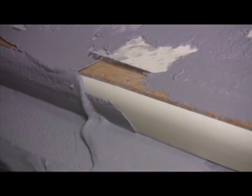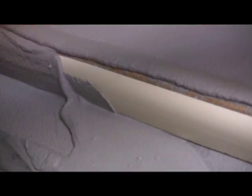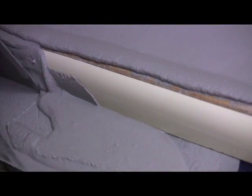The bond coat remains workable for about an hour, so there's no need to hurry. A benefit of making samples is that you will have gained confidence in working with the trowel and the materials. If the surface begins to feel sticky, lightly spritz with a diluted polymer. This will lubricate the material and allow the trowel to glide more smoothly. Don't use water. Water will weaken the slurry.